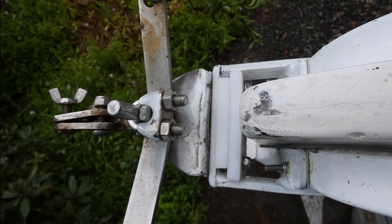The rudder modification is not a traditional one — most people on the RL move the pintles to make the rudder more vertical. What I've done is open up the back of the rudder box at the top to allow the rudder to rotate backwards at the top, making it more vertical while leaving the pintles where they are. This puts about 10-15% of the rudder's surface in front of the pintle rotation line.